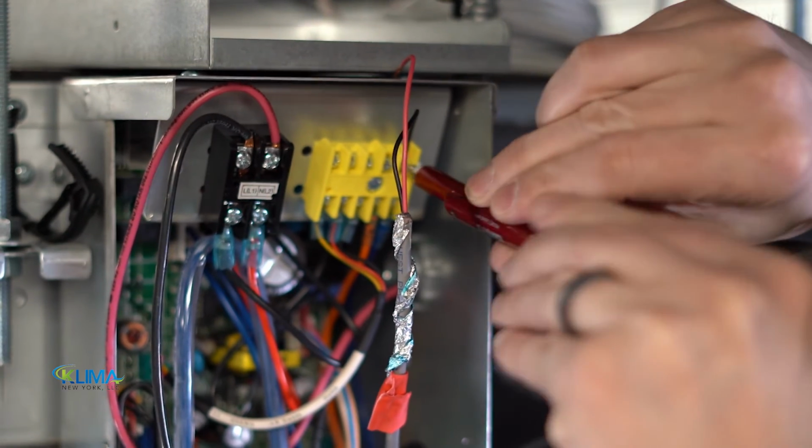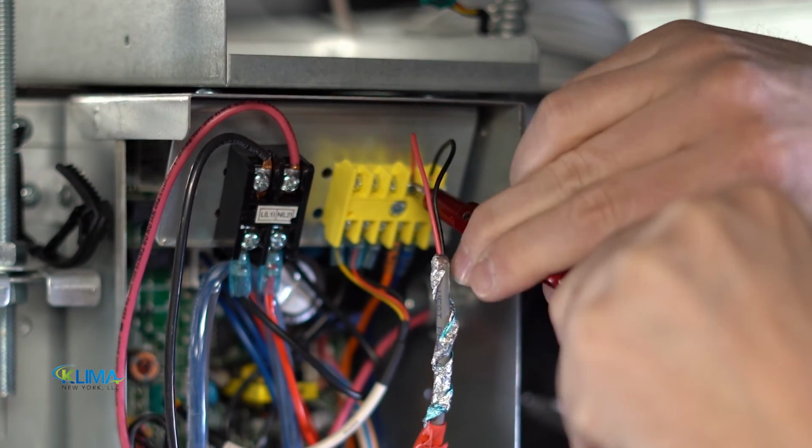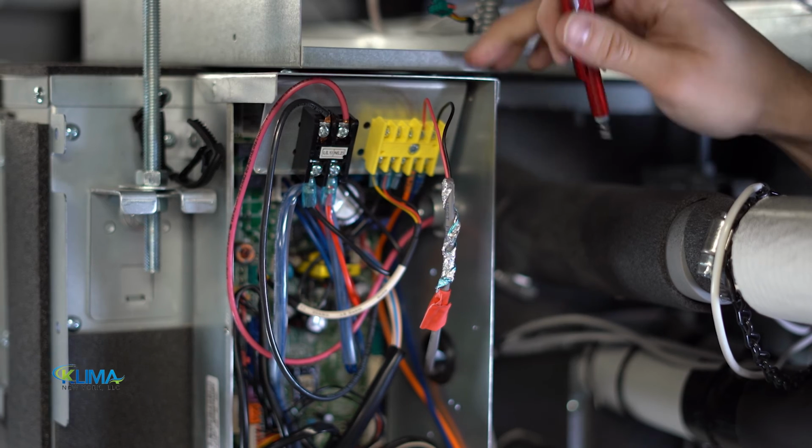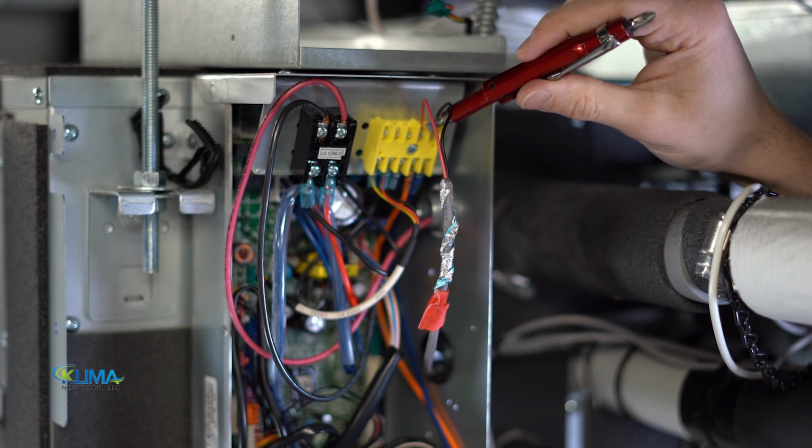Now we are at the last indoor unit on the system daisy chain. Since the communication bus on an LG VRF system is a daisy chain, you will continue that daisy chain wiring until you get to the last indoor unit or HR box on that system. Land your black wire under terminal B and your other wire on terminal A. Since this is your last unit in the daisy chain, there should be no more than 1 wire on each terminal.